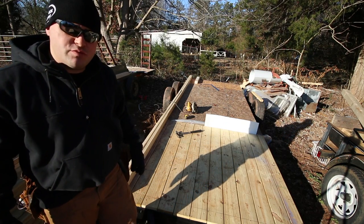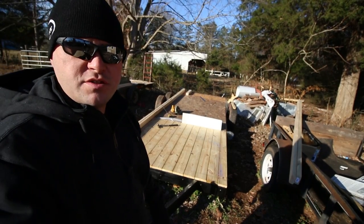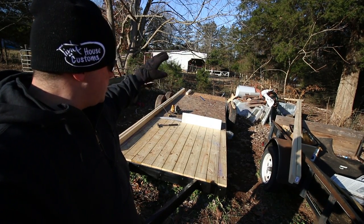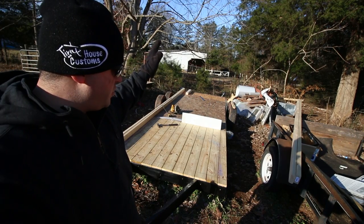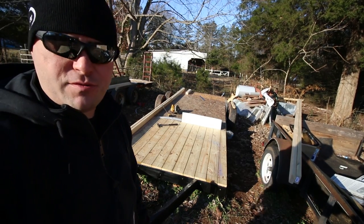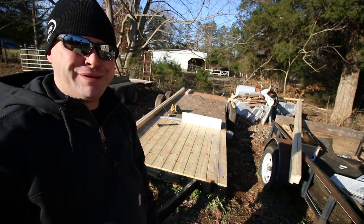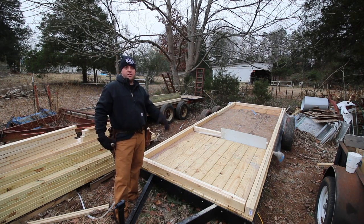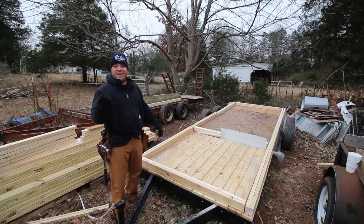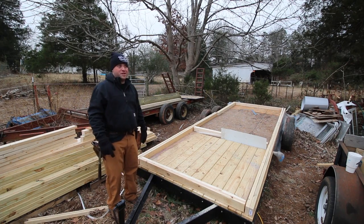Then we will lay the plates out. Sometimes it's just more fun to just work. To be completely honest, I could do this whole structure in one day — frame it, get it all up, squared, most likely plywooded, and some rafters in. But that's not what we're about here at Tiny House Customs — we're about educating and helping people. A few weeks ago I did a video about the vapor barrier, and a couple of you commented about where to get the correct tape. Thank you — I've ordered it and I'm going to fix it, because that Tyvek tape is not working too well.